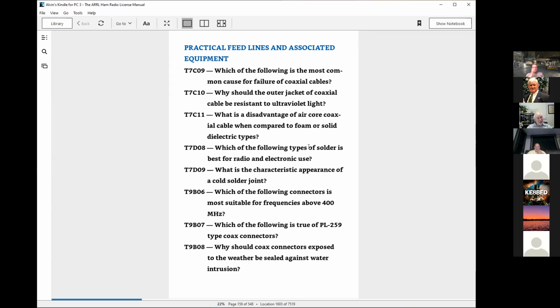What happened was a subcontractor for them made the solder holes too large. And when the components were put in, they had to use more solder to fasten it properly. After 30 years, the solder started crystallizing and not making contact anymore. I mean, there were a few other things wrong with it, but that was the primary thing. I sent it to a fellow in Florida who specialized in these things. He went over it with a fine-tooth comb and it came out better than factory new. But that's what can happen if you have a cold solder joint, which looks grainy. A good one looks shiny.